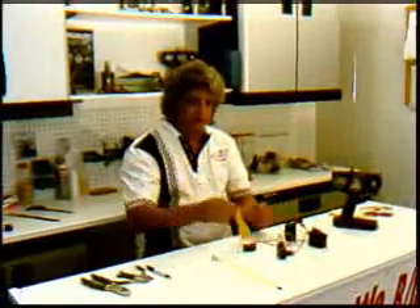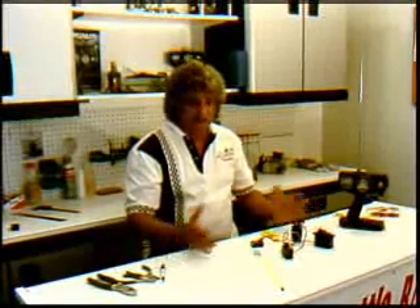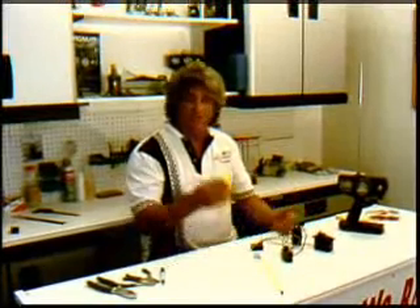Same with the receiver — put it in a balloon, twist it, bring all the wires through. Okay, there's a little bit of a pain, it takes a little bit of time. The worst problem is, when we're done for the day, these have got to come out of the balloons — because we can do the same amount of damage by leaving them in. What happens is condensation — just like if you leave the radio box taped up, the humidity can actually form inside the balloon. Three months later, you go to take your boat out of the shed, you open up the balloon, and the receiver is no good or the battery is all corroded. So it's really important when we're done for the day that we remove the balloons.